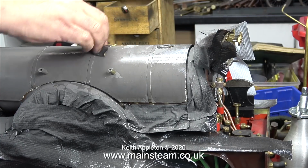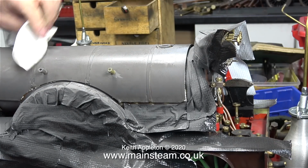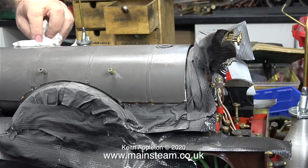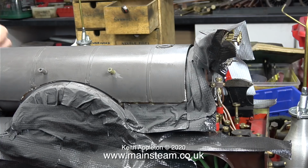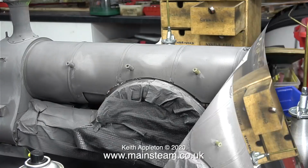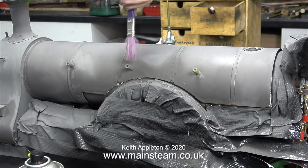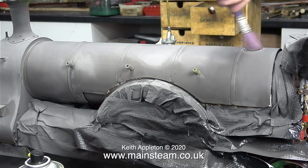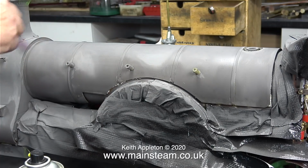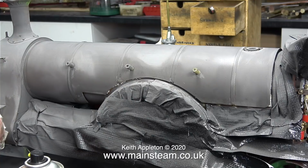To get rid of the excess water and clean up the particles, I used a clean, dry cotton cloth. After thoroughly wiping the smokebox and the boiler wrapper with a cloth, I repeated the process with an even cleaner cloth. Then I used a paintbrush to get into the corners between the boiler banding and the main boiler wrapper. Once the smokebox and the boiler wrapper were thoroughly dry, I repeated this paintbrush job, but I used some panel wipe to remove any particles that remained there.